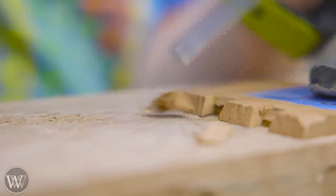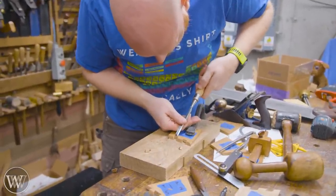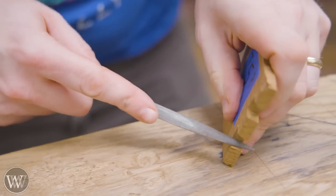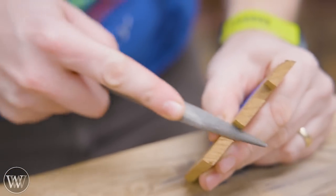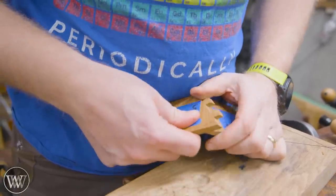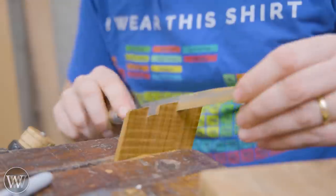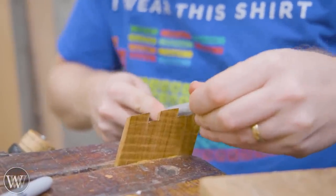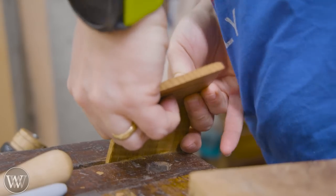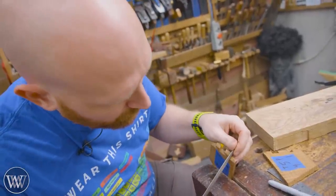There is still a little bit of breakout, but that's okay — we're marching through these. If I really wanted to make perfect dovetails, I could take far more time, and I may in the future actually go back and do this project again with more care. At this point, I'm just trying to make one that actually works. This one will have a lot of gaps because I just want to make it. I've been trying to do this so many times and I just want to see this come together, because there are still other steps: how do I put in a groove that holds a bottom? How do I flatten out the top and bottom? There you can see I'm filing again, but I filed a little bit too far into the corner — you live and you learn and then you adjust your technique.